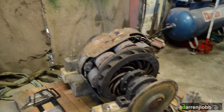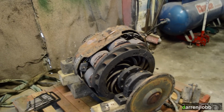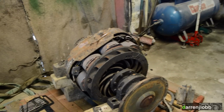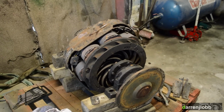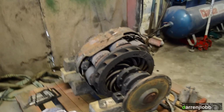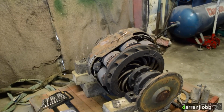For all we know, there could be coils here open circuit, they could all be open circuit and melted or whatever from previous abuse. I've got no idea of the history of this dyno. What I do know though is that this eddy brake hasn't been used for a long time. The previous owner was running it as an inertia only unit, so we need to get this working. Obviously a worst case we could have melted coils. They're aluminium windings from what I can see, so corrosion could be a problem.